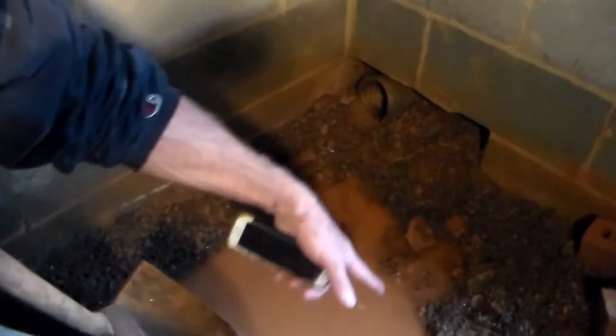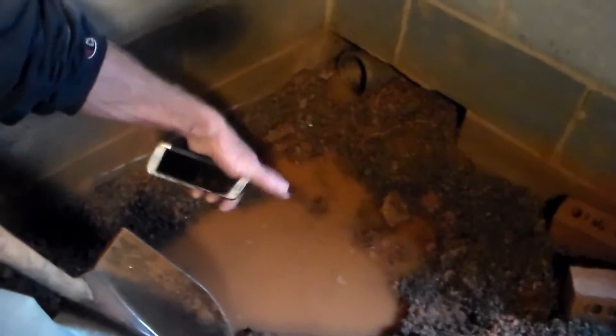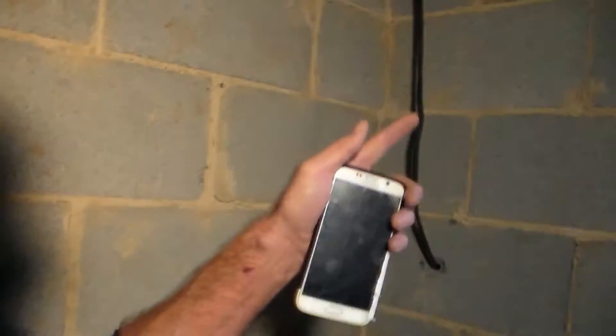What we're doing is going to put in this corner — you can see the area that we've already started to dig out just a little bit. We're going to put a sump pit and a sump pump. We're going to lift that water up from the pump, come out, and go through the wall over there because it's a little easier to get to the outside where we want to hook up the pipe. The homeowner could do this themselves. It's really a straightforward job, take you about two to three hours, and we're going to show you how to do it. Let's get started.